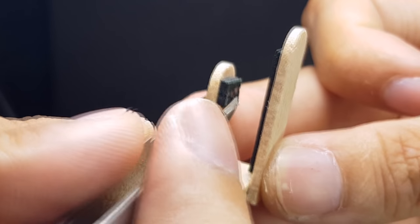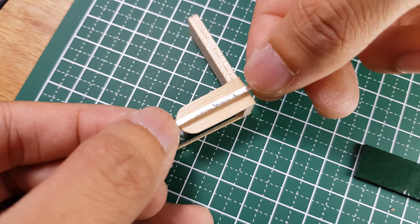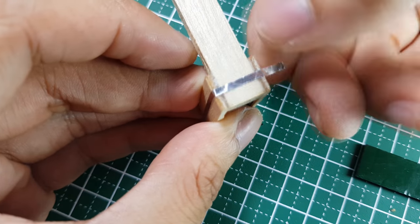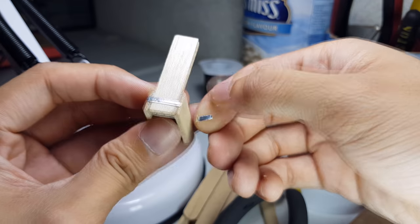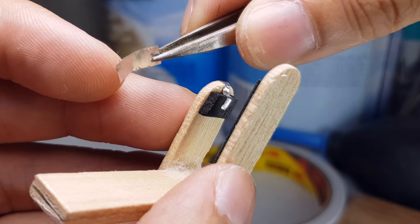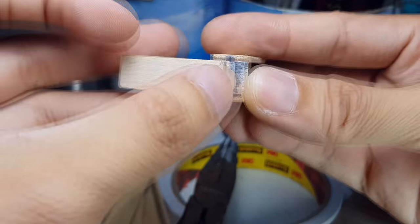Put the contact point close to the tip of the shorter popsicle stick, then remove the plastic cover of the double-sided padding tape. Cut a small strip of aluminum from your homemade aluminum tape, then wrap it around the designated areas. Scratching the surface first will make it stick even better. If there are any excess pieces, use your fingernails to tear them off. Using a pair of tweezers, carefully guide the end of the aluminum tape to the surface of the contact point. Cut a rectangular piece of aluminum tape to cover the whole area, then add one on top as well.